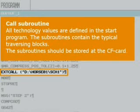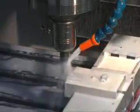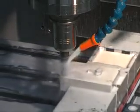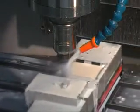The geometry programs are called from the start program via an EXT-CALL command. Each machining strategy has a geometry program — that is, at least three geometry programs are used for the roughing, pre-finishing, and finishing.